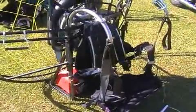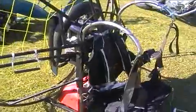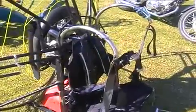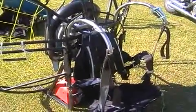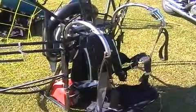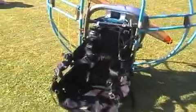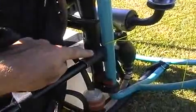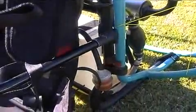This paramotor is exactly the same as the previous one, however it uses J bars, and the bars, instead of coming under your arm to support the harness, come out over your shoulders. It's an older design and very easily converted to the under the arm bars by taking these J bars out and attaching a new harness system, which really consists of a bar, either square tubing or round tubing such as that, which is welded to your frame. A bar slots in with a securing bolt, and at the end over here is just secured to the harness via 2 pop rivets or bolted to it.